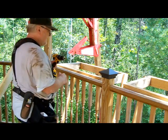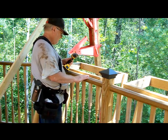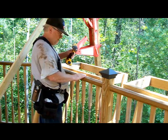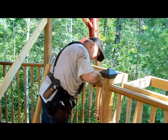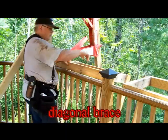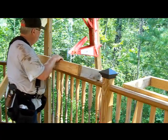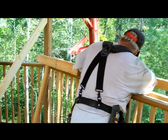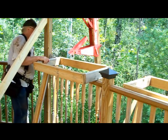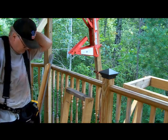These scaffolding extenders are attached to the railing, the upper railing of the banisters. So, first step is to remove the screws to the brace, the vertical brace that holds it in place. So I just bring that up over the banister. And then I remove those, well, they're diagonal braces actually. So, that's the upper extender.